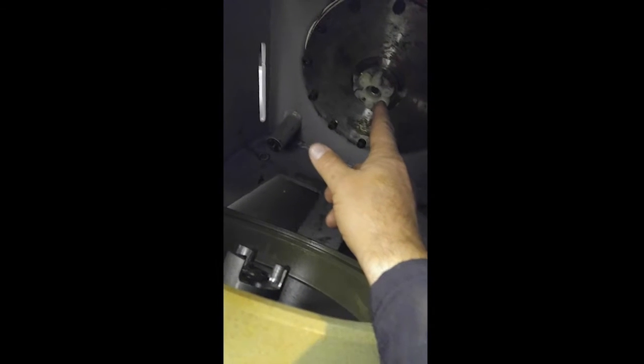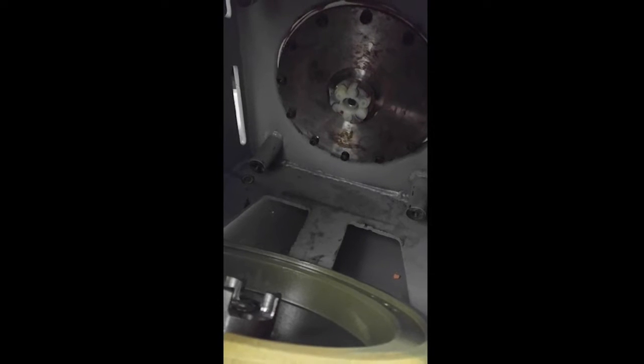Okay, I've got the flywheel partially pulled out. Lean it and roll it out just a little bit, and you'll see here's the motor side of the coupler. And there's the coupler bushing, and that goes into the oil pump on the other side of this. So here's the motor, flywheel, and coupler bushing, which connects then to the oil pump. Depending on your use, that bushing is one of the maintenance items of a press and does have to be replaced.